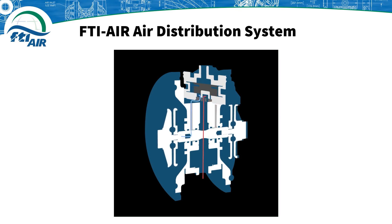Here's a short looping animation of how the air valve actually works. It is a common misconception that compressed air is used to force the valve carrier to move up or down. We are actually creating a low pressure area at the top or bottom of the air valve, depending on its position in the cycle, and that low pressure area is responsible for the movement. In the animation, the blue line is compressed air going into the pump, the red line is exhaust air traveling out. Green circles appear at the moment the turned shaft is breaking the seal of the O-ring and signaling for the pump to shift back.